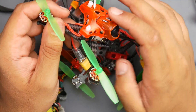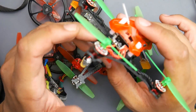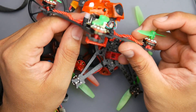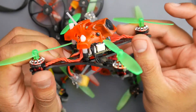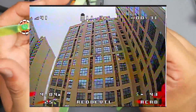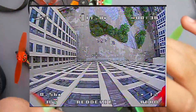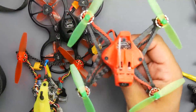It turns out I burnt something on the VTX — it's damaged, and whenever it's connected nothing boots, but the flight controller is still alive. So I came up with this Frankenstein solution between a trash can and a Red Devil, and it worked out great. Now I have another toothpick, which makes me really happy. It flies almost as good as a Happy Model Sailfly after only five flights with this modification. You can get whatever's on sale basically, but keep an eye out for possible shorts — very important with the Red Devil.